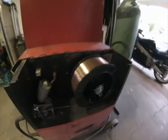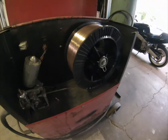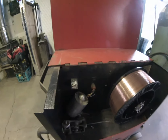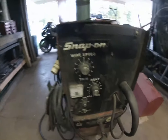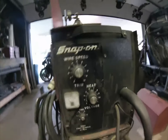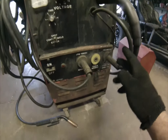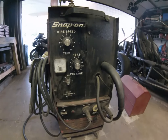Under the hood there's another 33-pound spool of 0.035 MIG wire. This is the contactor — since 2007 I've probably had to change it twice; it's sort of like a fuse, they do blow. It's a simple welder: I've got my wire speed, my heat, and that's pretty straightforward.